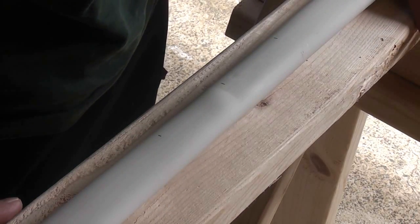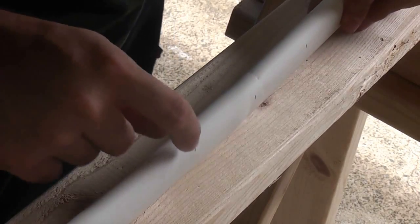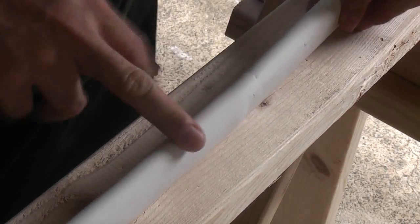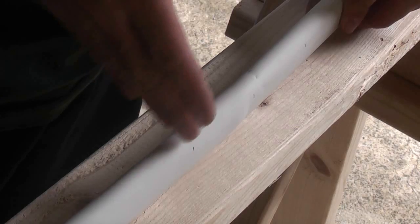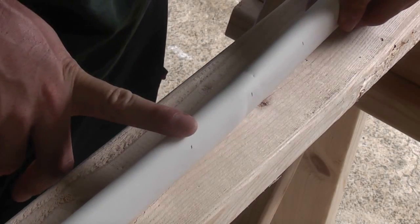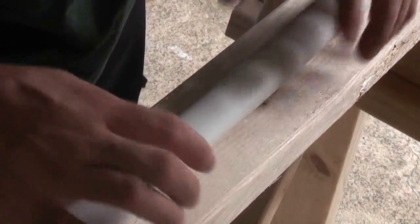Now the fades or fade-outs are very important. What we're looking to do is make a nice transition from the limb into the handle. If there's too sharp a crease here, what will happen is that this will be a weak point and the limb could just fold over right at the handle, or it could break here. So what we're trying to do is re-establish this handle.